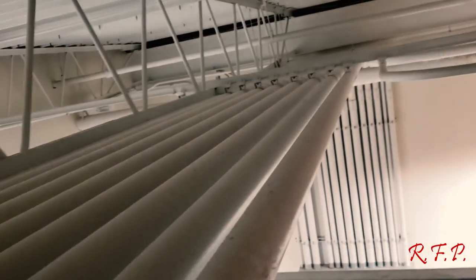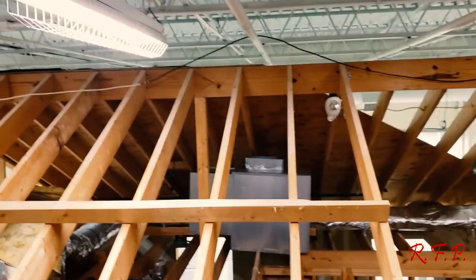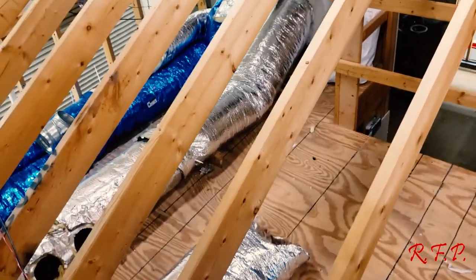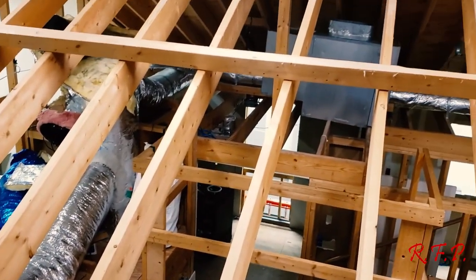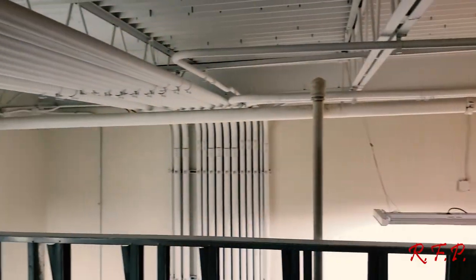They're a little more fun to get in there and clean. You can get in there, get up under the return a lot of times and clean the coil in an air handler. But on the gas furnace you've got to get in there and slide the coil out just about to clean it. And a lot of times that means cutting the lines and taking it outside and washing it. What happens if you got to cut the lines? That's a half a day job, man.